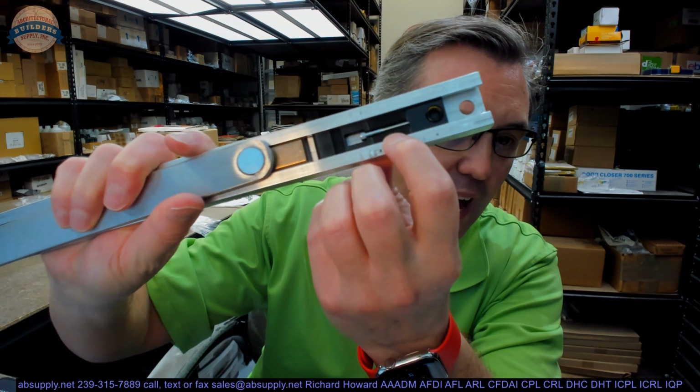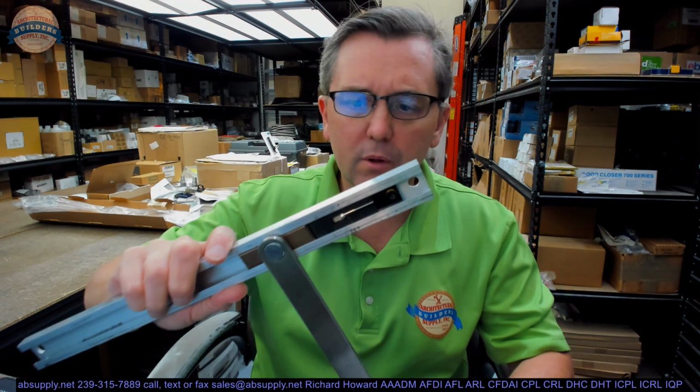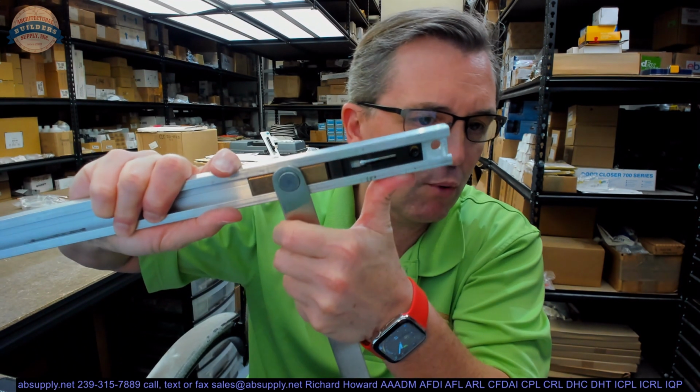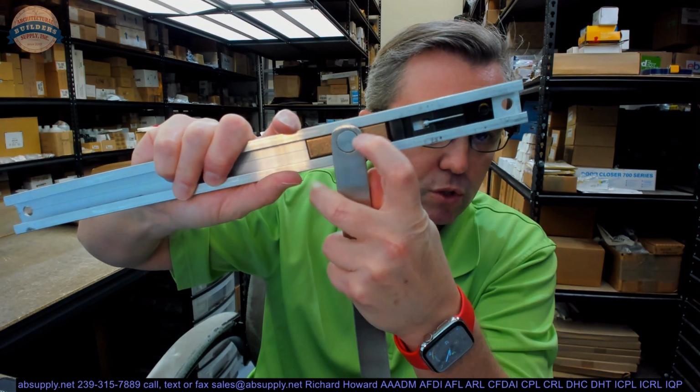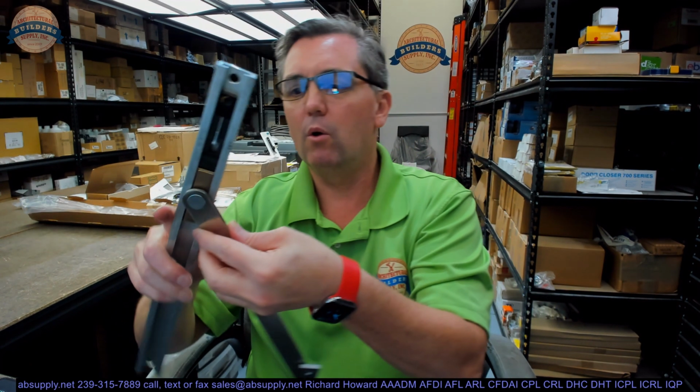Now in this unit, and then we'll get to the catalog, but right here there are a couple of pieces of what are probably a dense closed cell neoprene so that it will compress in a hyper extended application. I can't compress it with my hands, but those two little pieces of deadening material there will allow 5 or 7 degrees of movement in the door before it will truly dead stop, before all that bottoms out.